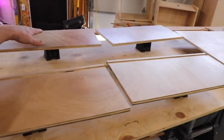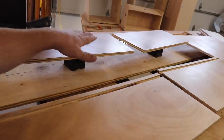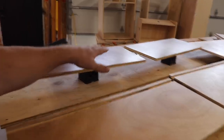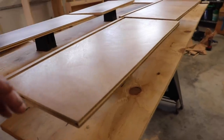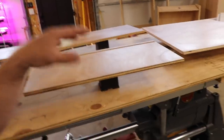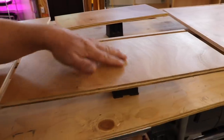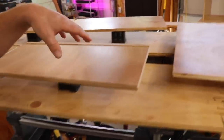That's what it's for, basically paint prep, to remove the last little dust from your finest grit of sandpaper. So in the back here, I used the tack cloth, and we're only at 5 coats, and those look fantastic. I probably won't touch those again with another coat. I feel like these took more. I feel like you can see the depth of the wood. It's definitely sanded to 220, but maybe I didn't sand it enough, and when I touched it with the water, I think I made it more rough. And so I think it took more lacquer to get that sealed.